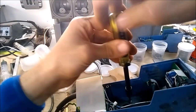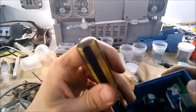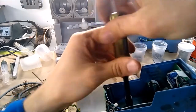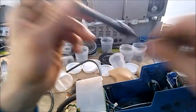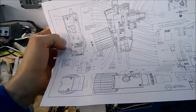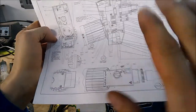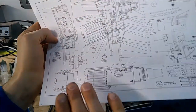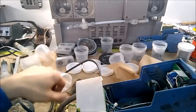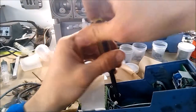When the screws are removed the motor will hang free — don't let it hang off the motor wires because if you damage them it's a real pain to rewire. However, if you get hold of the schematic diagram, which I'll try to leave a link to, it explains all the wiring. If you need to order spare parts there's a chart — you send an email and they send you a quote and the parts. You can also send it directly to them for repair, but if you're watching this video you probably want to repair it yourself.